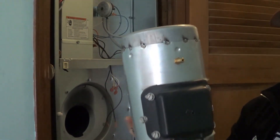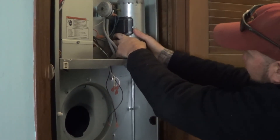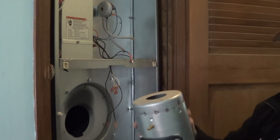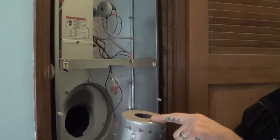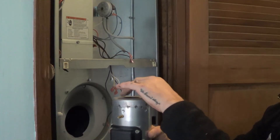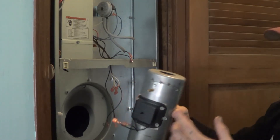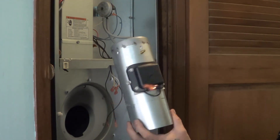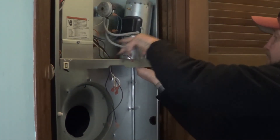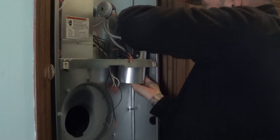We'll just redo that exact same thing to put it back in — put the new one right back in. As a note: if this is not working and you've tested it with pressure, sometimes I've actually had a leaf sitting right on there so it would kind of blow around. Sometimes it works, sometimes it doesn't — so make sure that fan blade area is clear. But if it's not working, it's not working. Be ready to replace this.